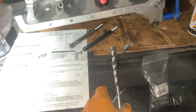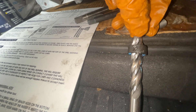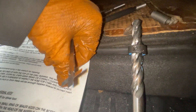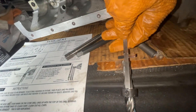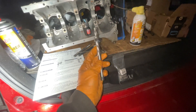Then you grab the special drill bit that the kit comes with and you install this step that you just measured. The adapter has an Allen lock — you just tighten that up and that's where the drill is going to stop at that step. Next is the actual depth of the hole — we're getting about 40 millimeters, which is exactly how much the rest of the drill bit is. Once you've measured your distances properly, make sure everything is tightened properly.